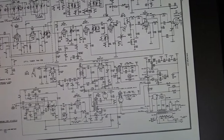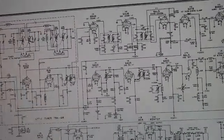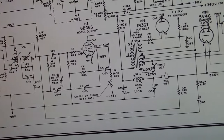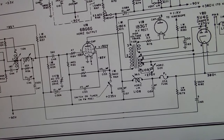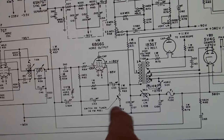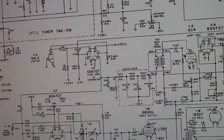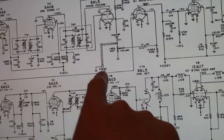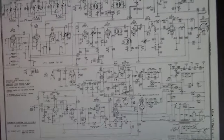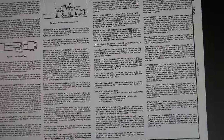There's another version that looks pretty similar. I just noticed something — there's a switch marked 'Switch on tuner' in the FM position. Maybe it's for versions that add an FM radio, and while you're listening to the radio they kill power to the horizontal output tube to kill high voltage to the picture tube too. I'm still curious about that switch. For the phono jack, they show it wired straight into the volume control with no switch anywhere. Well, that's basically what the schematic shows — hopefully it matches things pretty well, and that's all we get for this company.